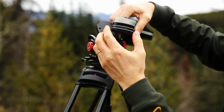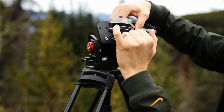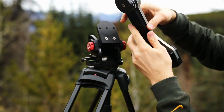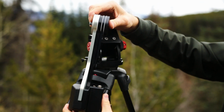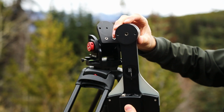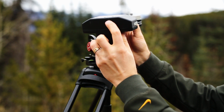You'll notice that there are screw holes along the perimeter of the top of the drive arm. Depending on the iteration of your mount, you might have 3 screw holes around the perimeter, or you may just have 1 at the top. These contain set screws which hold the LighTrack II's stack in a static position. If you ever find that the attachment is rotating back and forth, that means that your set screws need to be tightened.